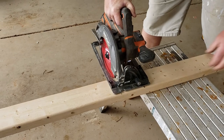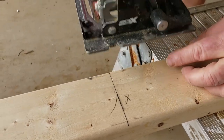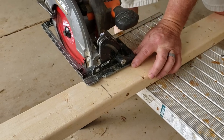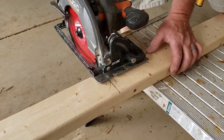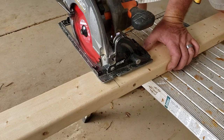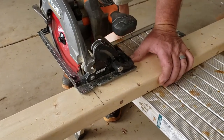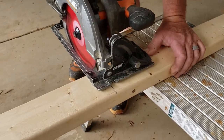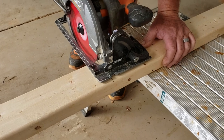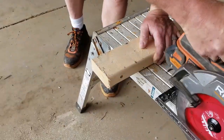When you're doing rough framing you don't need to put a speed square on it - it doesn't need to be perfect. I know my blade runs right true down this gap here, so I run it so that gap is right along the side of that line. I can see the distance here and sometimes I put my thumb here so I can do it that way. Once the blade gets going it'll cut and run smoother. I don't recommend putting your hand anywhere else. Bring the blade up to running speed before you start cutting.